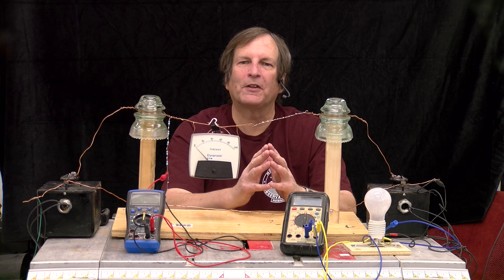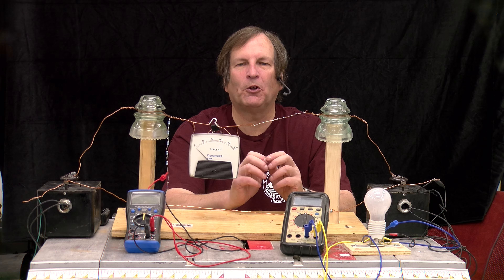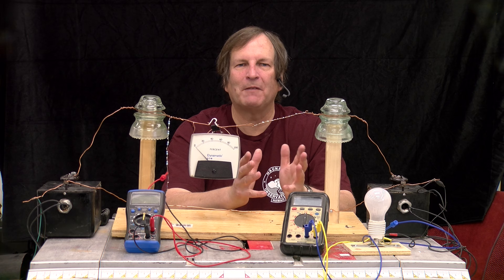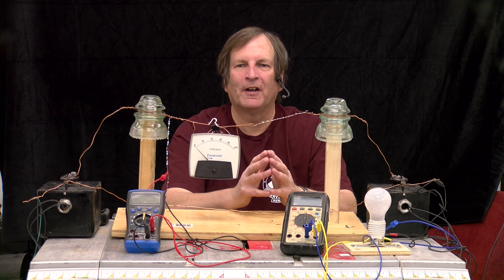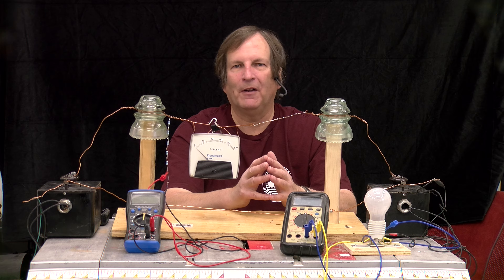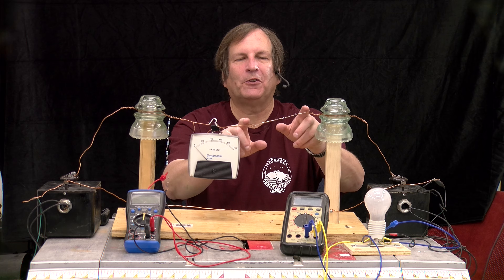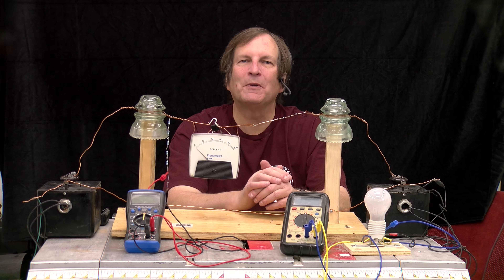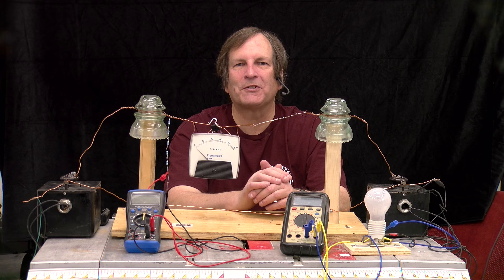The question was how to test and mitigate that. What I thought was the best approach would be to cover the voltmeter in some sort of a metal frame — a metal structure — to elevate the potential all around it to 10 kilovolts, the same voltage as these wires. I used some aluminum mosquito mesh, the type of stuff you put on windows, to do that.